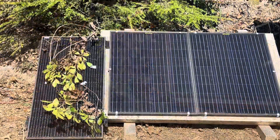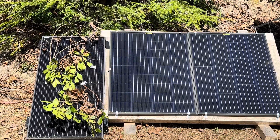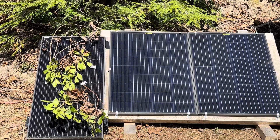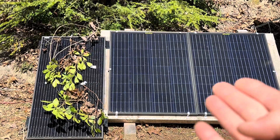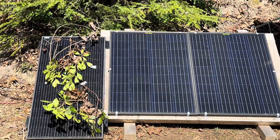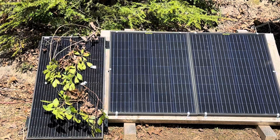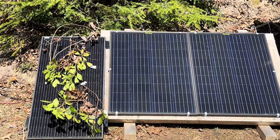As for panel ages from the previous video: the Flex Solars have been out for about a year, the Optivolt roughly two months. For reference, these panels made about 82 watts each — so 164 to 165 watts for the set — basically no degradation from age. I've got some panels that are five and six years old that still make 99% of the power.